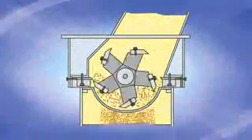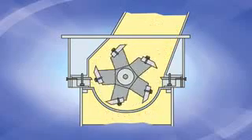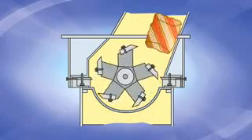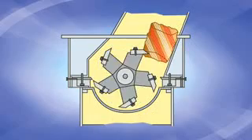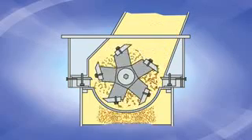This animation illustrates the disintegrator's seven blade cutting system. Five knives mounted on a solid steel rotor spin at nearly 600 RPM, passing two stationary bed knives. The result is a continuous cutting action that makes particles smaller and smaller with each pass until they fall through a waste sizing screen.